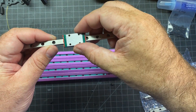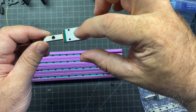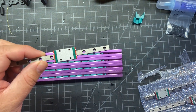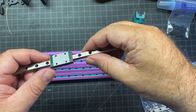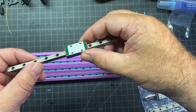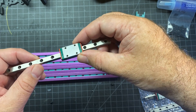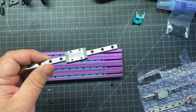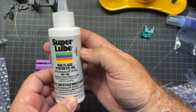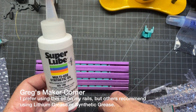I've got the first rail out, just took it out of the package. It seems pretty good but it's a little goopy, especially the carriage, so I'm just going to clean that off a bit. Depending on how fancy you want to get, you can either just wipe them down — which I think is all that's really needed — or you can use a degreaser, completely clean them, and then lube them up with a synthetic oil. This is the oil I use once I get them cleaned, and you just have to make sure periodically you put some on so everything's moving smoothly.